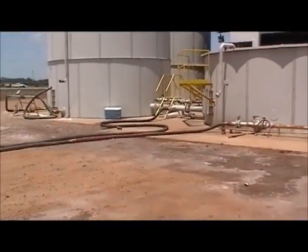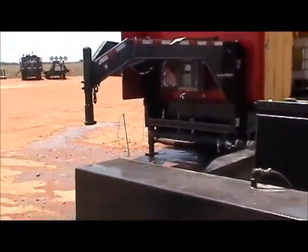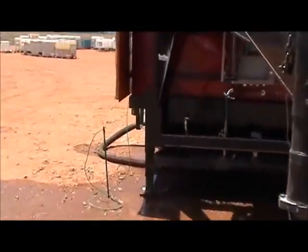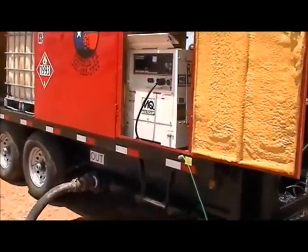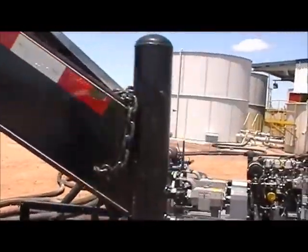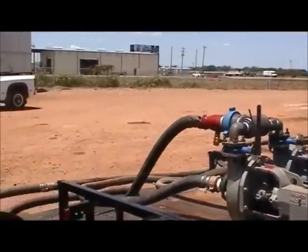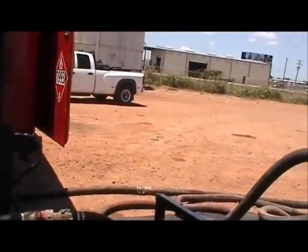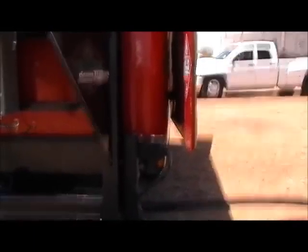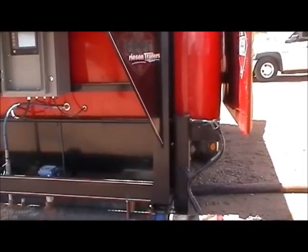Here you notice we're tied into the tank. The suction line runs over to the centrifugal pump, which goes into the front side of the hydration unit and travels through the hydration tubes on the undercarriage, exiting at the last tube and returning to the return tank. We're just making a big loop using the centrifugal pump to push through the hydration — it's really just a section of pipe where we're adding the chemical and mixing it on an in situ basis.